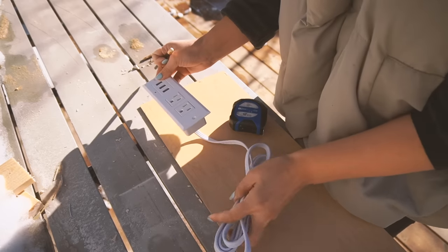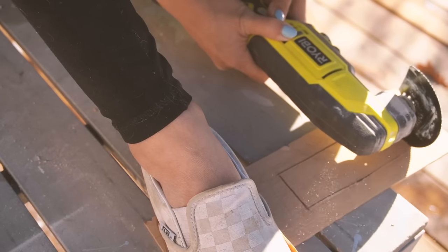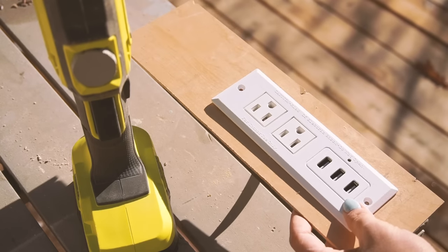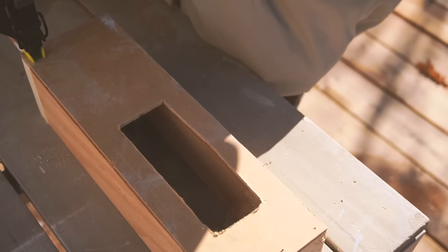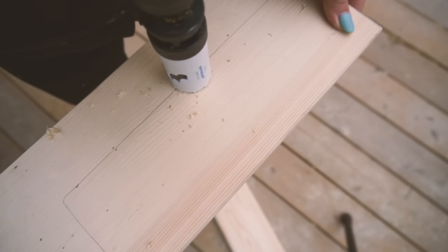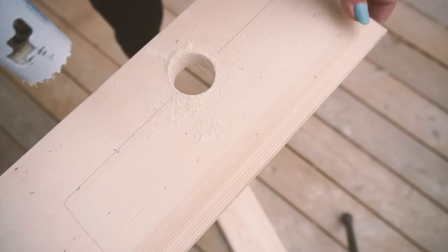I have a tabletop socket with USB ports that I'll link. I traced it onto the MDF base of the box before cutting to size — luckily it doesn't need to be perfect to drop right in. Then I used a brad nailer all over the box frame to attach. I traced out the size I needed on my pine and used a hole saw first to cut out the finger pull, so you have the support of the board before cutting out the rest of the lid. The finger pull is a semi-circle, which is why I wanted to cut it out with the hole saw first.